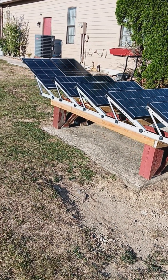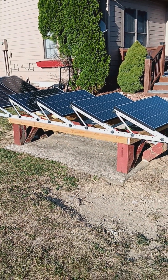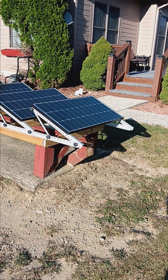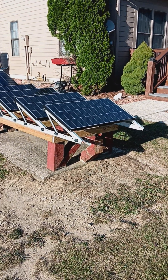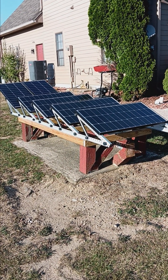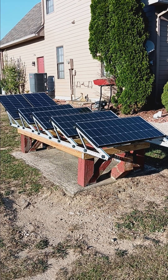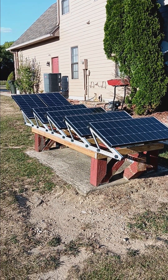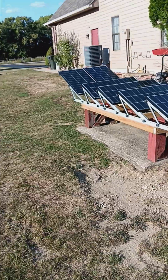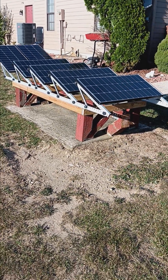I had the crazy idea to add a fifth solar panel, which mathematically did not add up — it brought my Delta II performance down to about 120 watts. Thanks again to the comment section, I found out that six would be better. So at the present time I've got two in series, two in series, two in series, and then all those paralleled together.